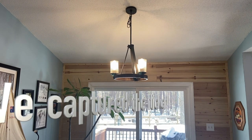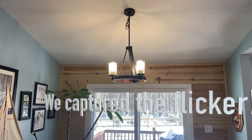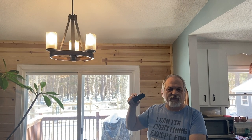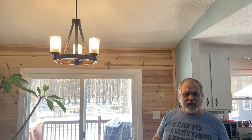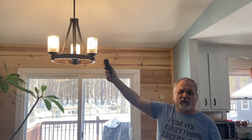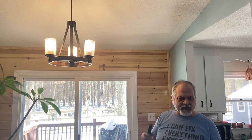So you can see it's starting to flicker a little bit here. In our case, our bulb was loose. If you wonder why bulbs get loose, it's because they get hot and cold, hot and cold — and that can work bulbs a little loose. This is not a very uncommon thing; it is much more common if you have incandescent lights, but clearly with LEDs it's also a likelihood. So this can be an easy fix. Even if you have to move it to another position and find out it's your bulb, that's still easy to fix — you just buy a new light bulb.